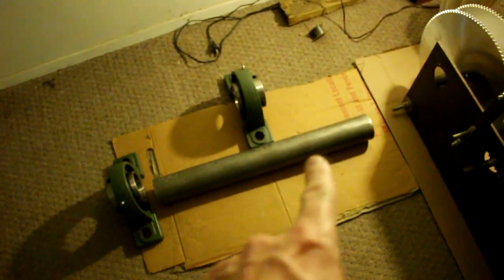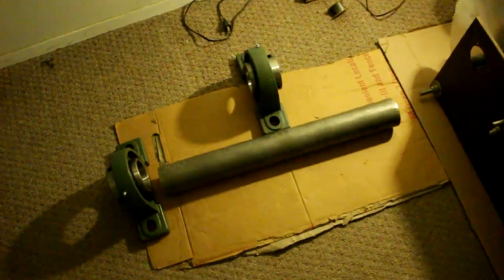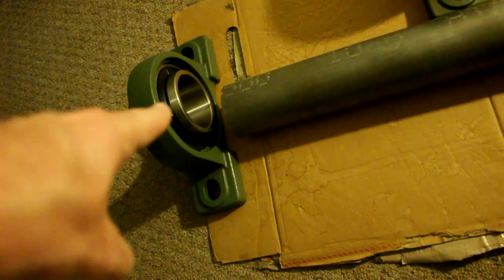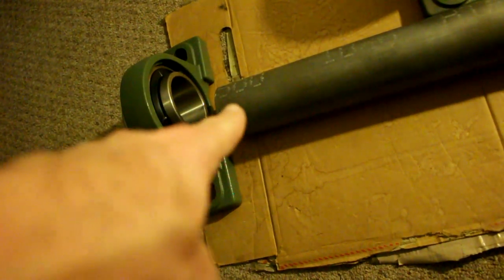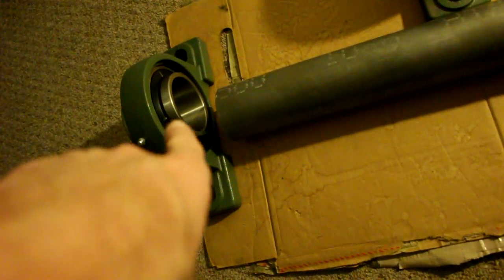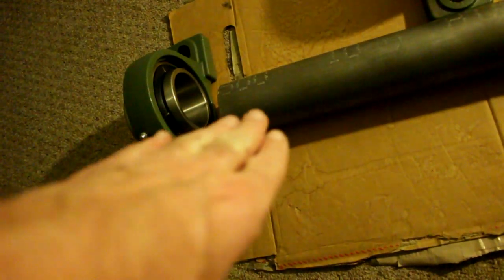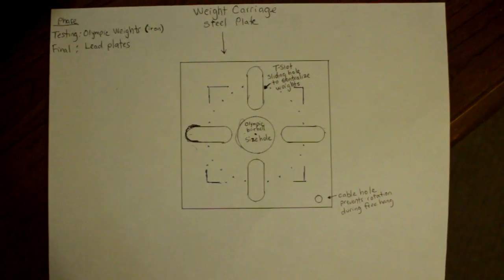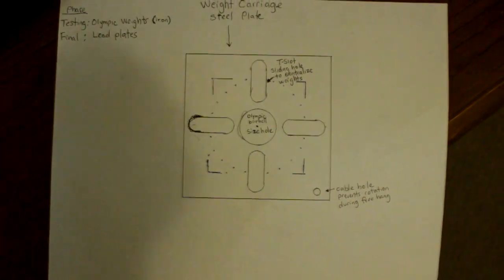There's a bit of machining that has to be done to this three-inch piece of material. We'll put it on a lathe and take off a few thousandths of the diameter — right now it's three inches and the bearings are three inches, so it won't fit. We just need to remove about one to three thousandths of an inch so it slides into the bearings.